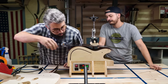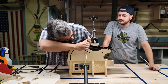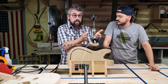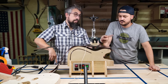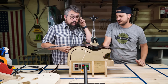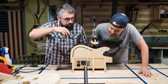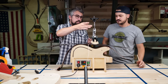We've got a thermocouple — basically a temperature probe — inserted right on top of the binding at the waist area to get an accurate reading. The very first thing we do is the waist bend — the waist is always done first. It's also why it's important to find that center location, because if it's off, you won't have enough wood to wrap around the whole side. I have the temperature set at 260 degrees Fahrenheit — that's a nice sweet spot; I have yet to burn a piece of wood.